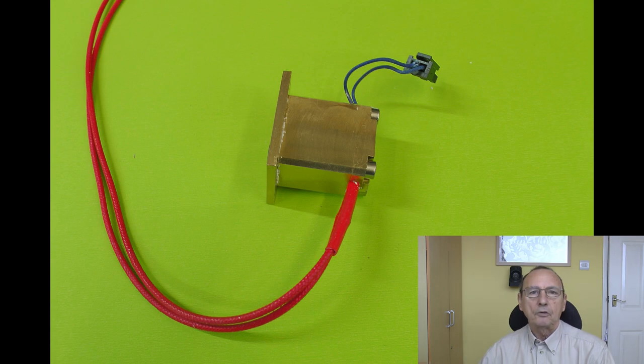The top part is just the plate that the heat breaks will screw into. And then the big chunk in the middle is the heater block. It's got two holes drilled at an angle, which converge at a central point. And then I've used a separate block for the nozzle, and most of the reason for that is the way that I've installed the heater and thermistor.